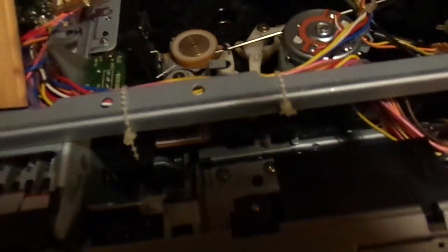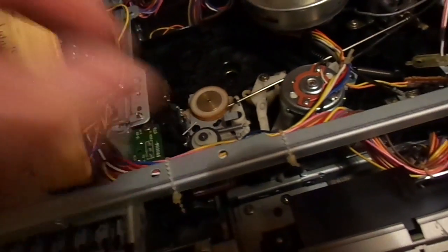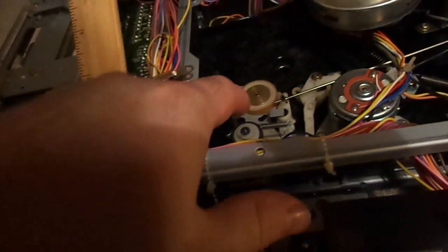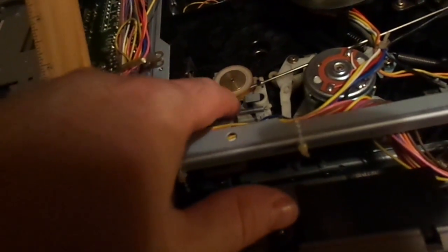Alright, this unit can run without that belt, but it will not run without the belt on the other side of this, because that, as you can clearly see, has a, it looks like it could be a magnetic sensor or an optical sensor. No, it's magnetic. That's what senses tape movement. If this doesn't sense tape movement...